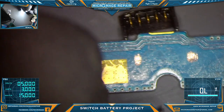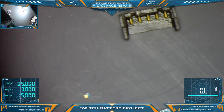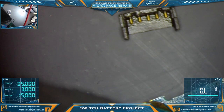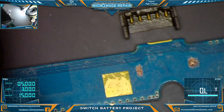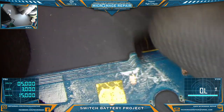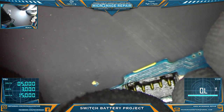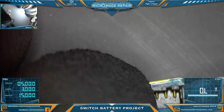What I may do is go ahead and coat this, because I'm betting that is a ground plane, but let me double check. Probably don't want those pins making connection to ground. Yeah, so let's coat that ground plane. Don't need that causing a problem. I don't think it would because we're going to be back far enough, but let's see. Have to remember we got to solder wires onto those connectors, on those pins too.